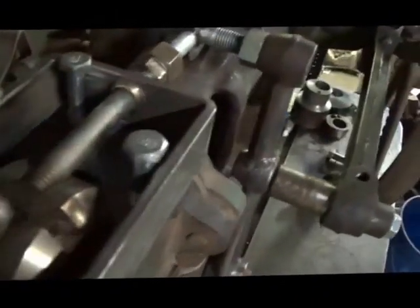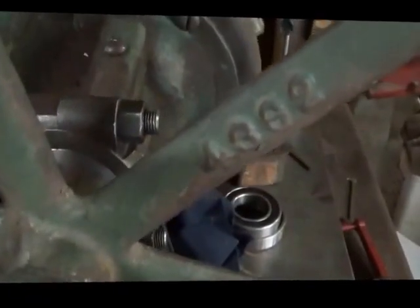I sort of like this. I know I said the more adjustment the better, but it looks like we may only have this one adjustment right here. I'm going to make a different bushing for this, or shorten that one up. It's got to be notched for the bolt to go through it — I'm going to do something so it'll pivot good. It's kind of funny though: if you look at the size of the connecting rod in the motor and then the linkage, they sort of don't go together too well. But that goes right back to the no-rules policy. I can easily get the adjustment out of here, and we'll probably just do that and put a set screw in it — a little tiny one. I've still got to do my lock on my eccentric — it's going to be a little easier than this one. With it being so much bigger, maybe I won't have to angle that one as sharp.